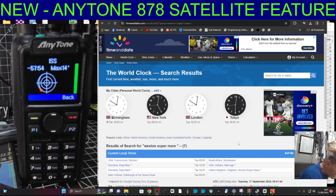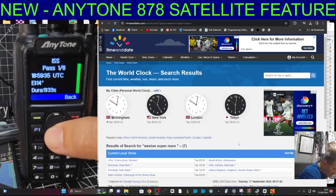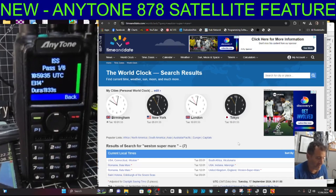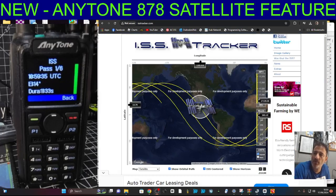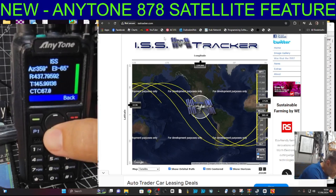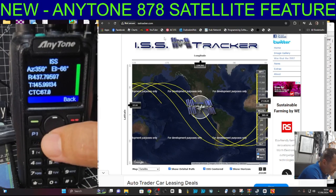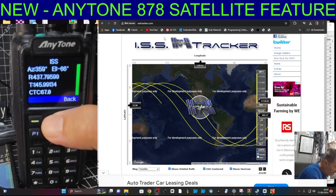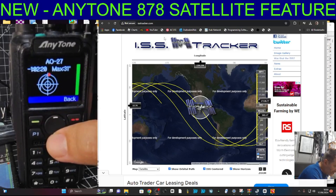You can see the little satellite icon. Clicking down shows it's going to pass at 10:59 - let's check what my computer says. Yes, you can see the pass path there - I'll put the link in. There's our receive frequency: 437.795 MHz, and you can see it changing as Doppler shift is calculated. Transmit is 145.99 MHz, also changing, and the CTCSS tone is shown. You can go back, select a different satellite, and get that same information.